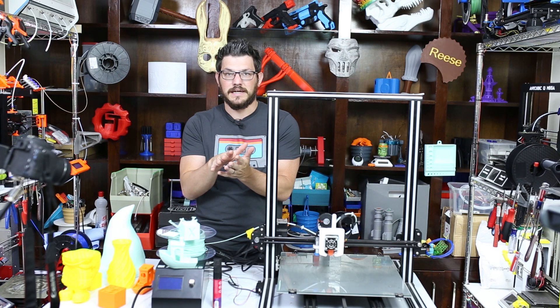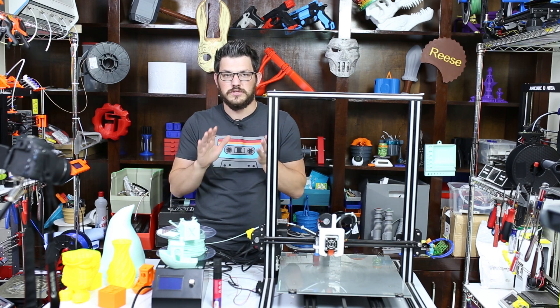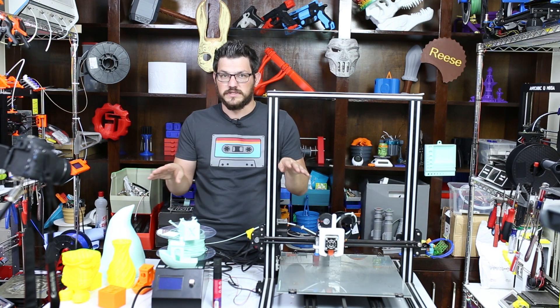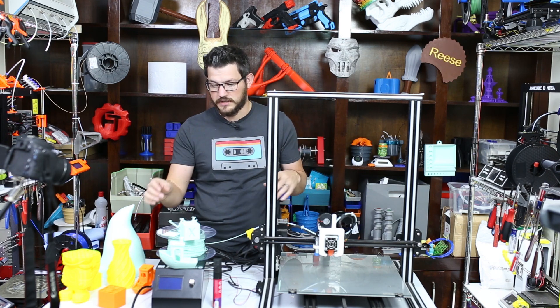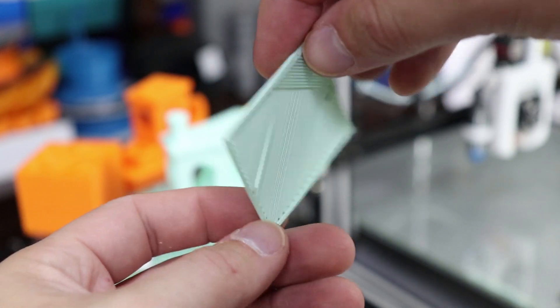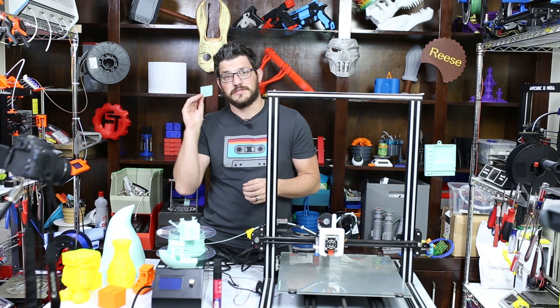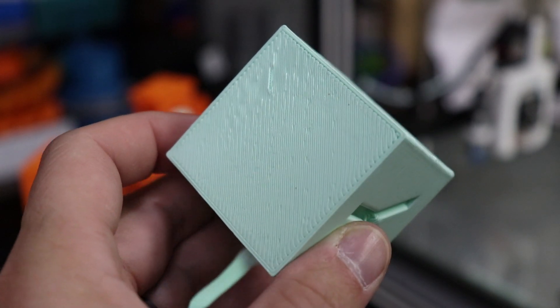Because it was so hot I was getting that wiggle effect where the filament goes down and is just so liquid — the viscosity is so low — getting these ripples through the first layer. So I turned that first layer temperature down and we were off to the races getting pretty good first layers. My first first layers were not really great, the paths are all too far apart, and that's where you really got to go back to tuning your first layers in Prusa Slicer. I went and did that and then I was getting much much better first layers. This one shows how it's a little bit too hot so you get that rippling throughout — you don't really want that.